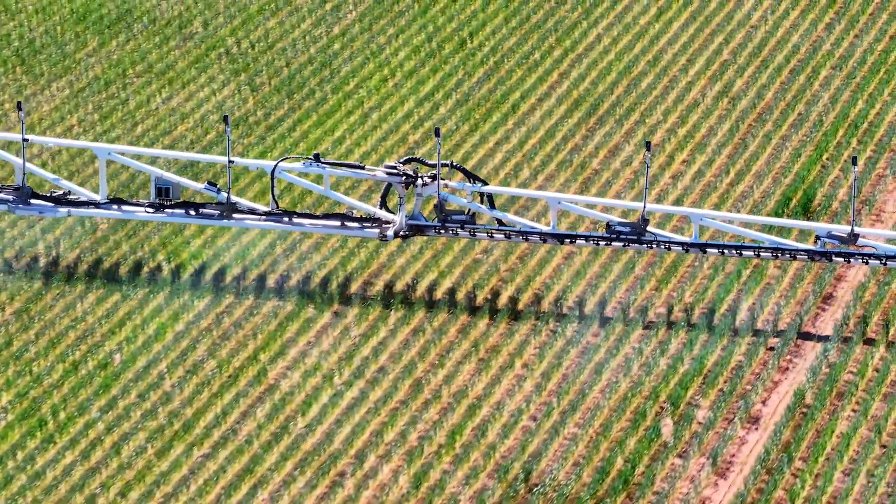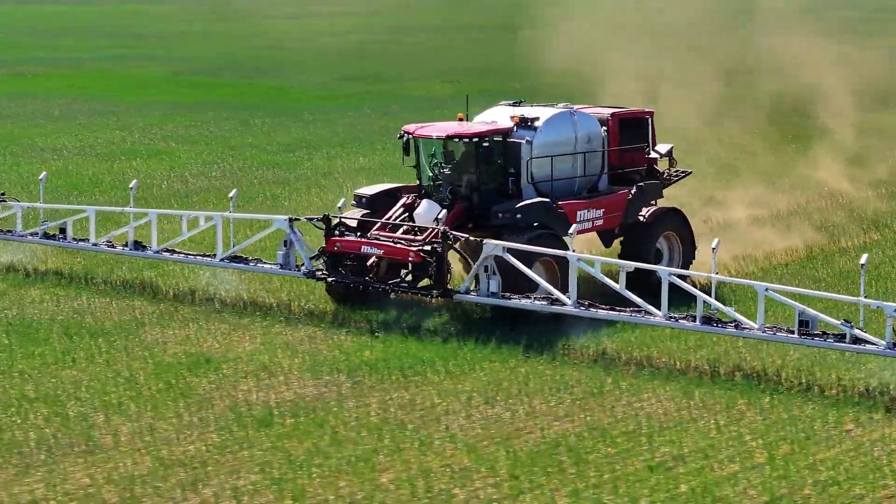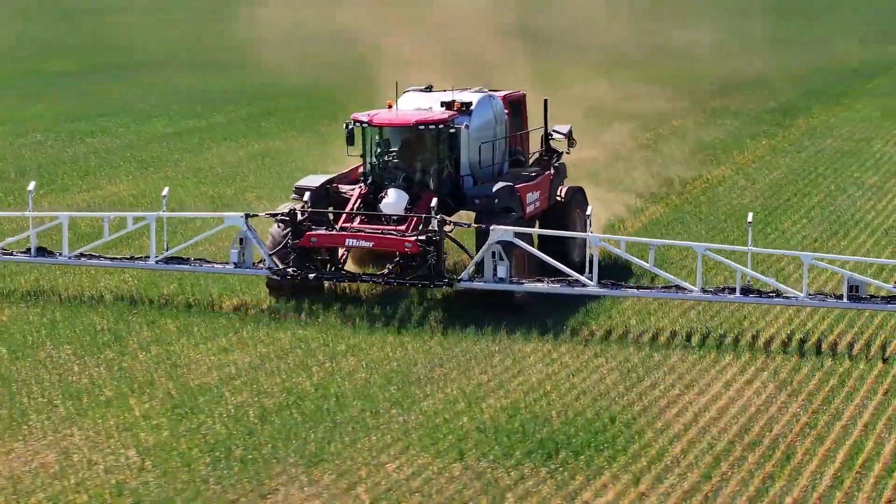You can afford to put a higher rate on of whatever you're spraying, so you're putting big droplets out — you know you're going to hit your target — with a fine mist behind it. The weeds die whether they're ten foot or one foot, because they're getting such a good shot of chemical all at once.